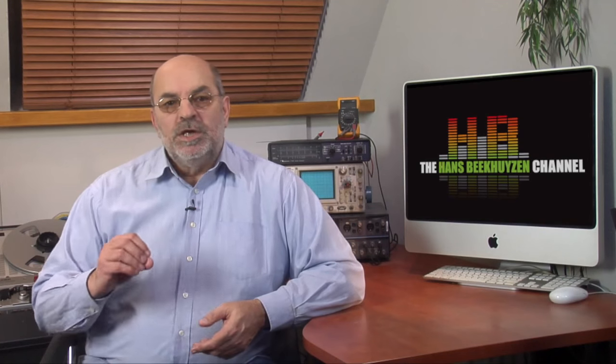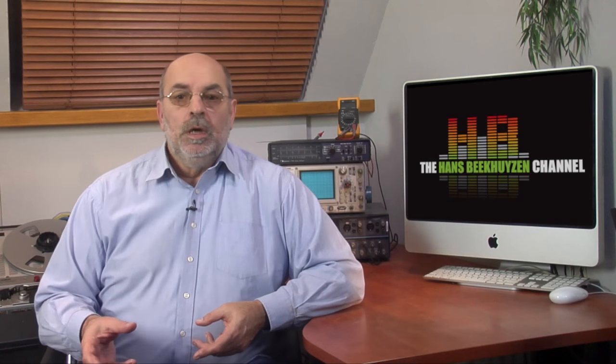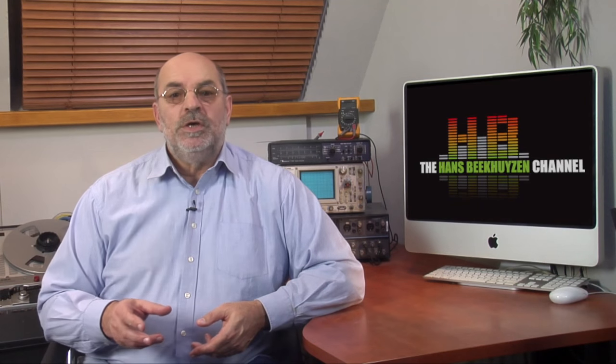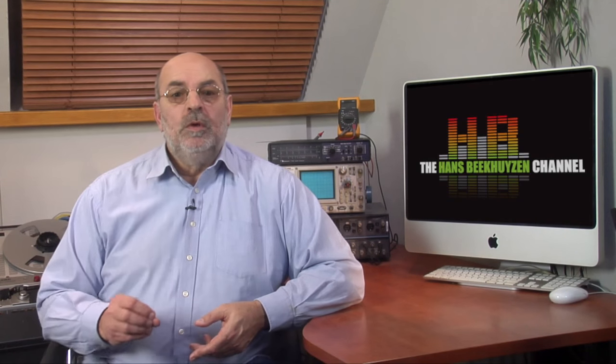The Jitterbug is nothing more or less than a device that cleans up the power line and the signal lines of the USB bus. It holds purely passive choking filters and therefore can have a positive effect on the sound when dimensioned correctly. Even on DA converters that do not use the 5V DC power line that is part of the USB connection, the ground will be connected.